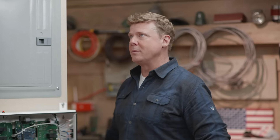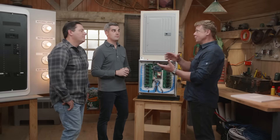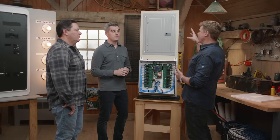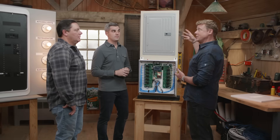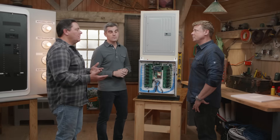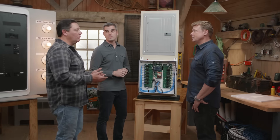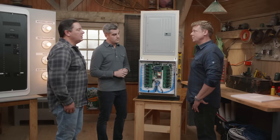When we've installed backup generators and it's not been big enough to power the whole house, you've had to sort of pick five or six critical circuits, wire them over to another box and say when the generator kicks in, that box is controlled, everything else goes dark. The old school was putting in a small generator panel specific to those circuits. A lot of times now we're actually doing a whole house transfer switch, transferring the entire panel or all the power going to the property. So you can run everything, but you still have to be aware of what's available. This kind of solves that for you.